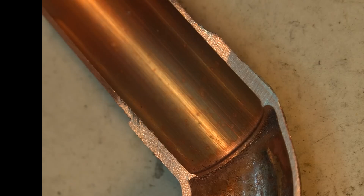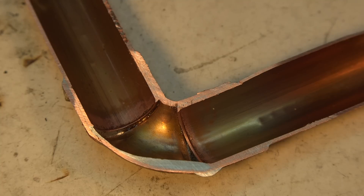Now here we're looking at the fitting that I put just a little bit of solder in, and you can hardly see the gap — that's why it sucks in like that with capillary action; it's very tight. And this is a good seal, it is sealed all around. If you look close, you can see there's a little bit of solder right there, which means it's come all the way through and has made a good seal. Very small amount of solder.